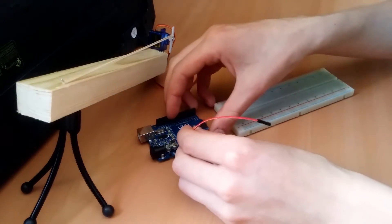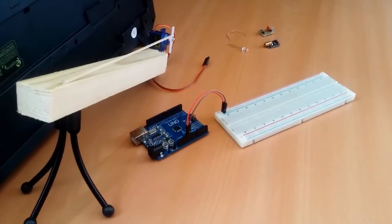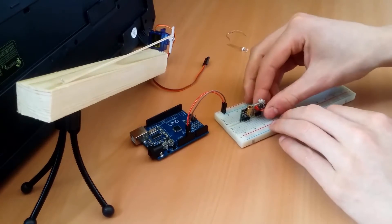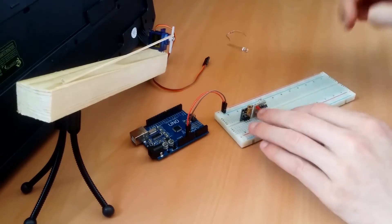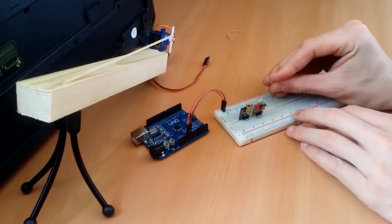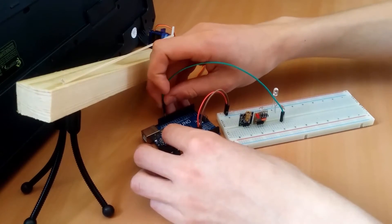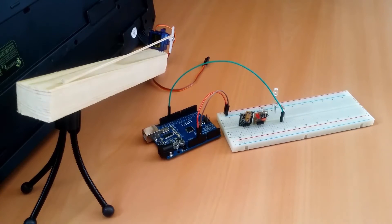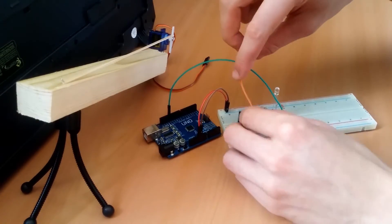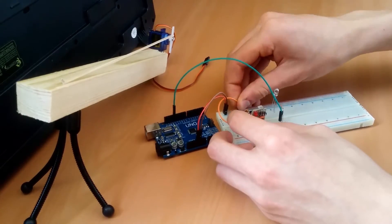So the wiring is as follows. We start by connecting the 5V to the positive side of our breadboard and ground to the negative side. After that we grab our modules and place them onto the breadboard — make sure to align the modules because this will make things a lot easier. Now plug in the cathode of the LED into the negative side of your breadboard and the anode to pin 13 with a resistor in between. Then connect the ground and the 5V input of the modules to the corresponding sides of the breadboard, connect the signal pin of the laser module to pin 11 and the signal pin of the sensor to pin 2.